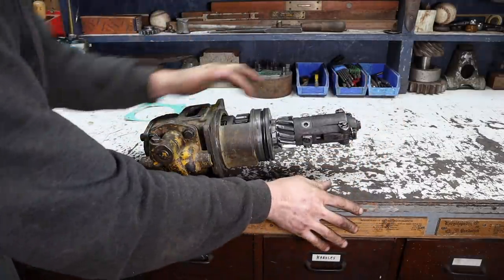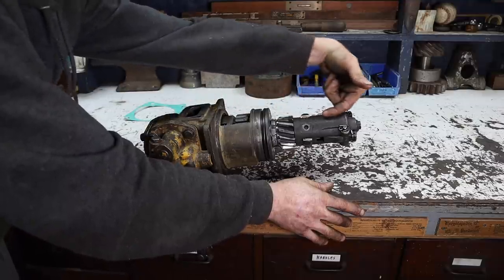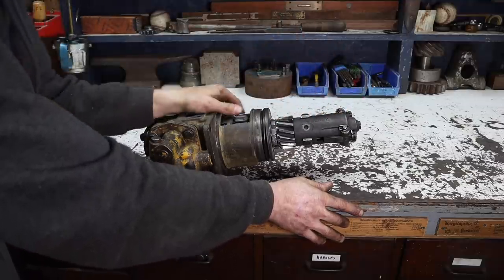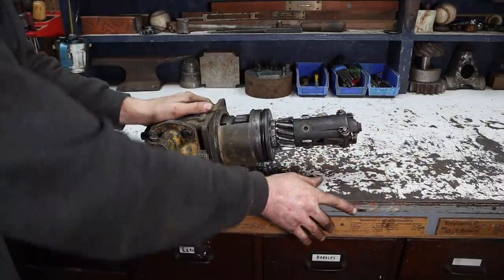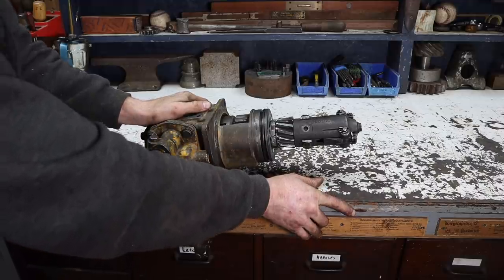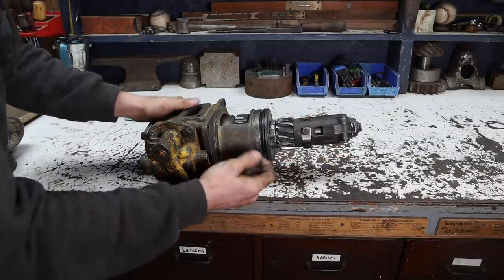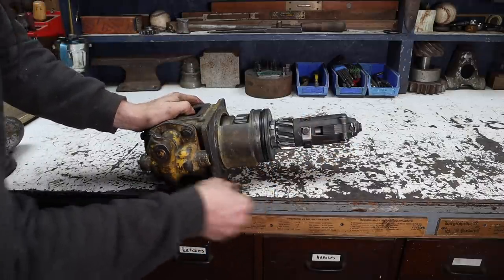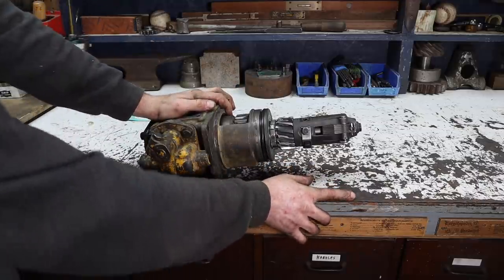So when it goes to engage, it brings the gear over into that gap where the flywheel's at, thus mating the two motors together, allowing this pony motor to start the big diesel engine. So, yeah, it's definitely a really cool way of operating the machine and the way it starts, and I don't want to lose this feature, hence we're keeping the pony motor.